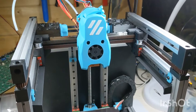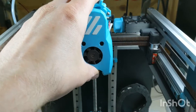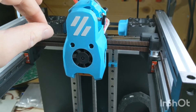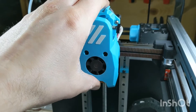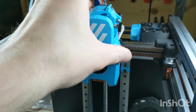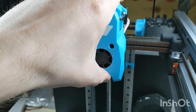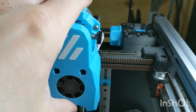Let's turn it around and have a proper look. That is really good. There is some play, of course, but nothing like there was before. Previously, due to the metal carriage on the linear rail, it would sort of jerk to and fro — you could actually feel it click side to side. There's none of that now. I can still make it twist and flex a little if I push it, but some of that seems to be coming from the plastic rail itself, which is probably the weak point now.